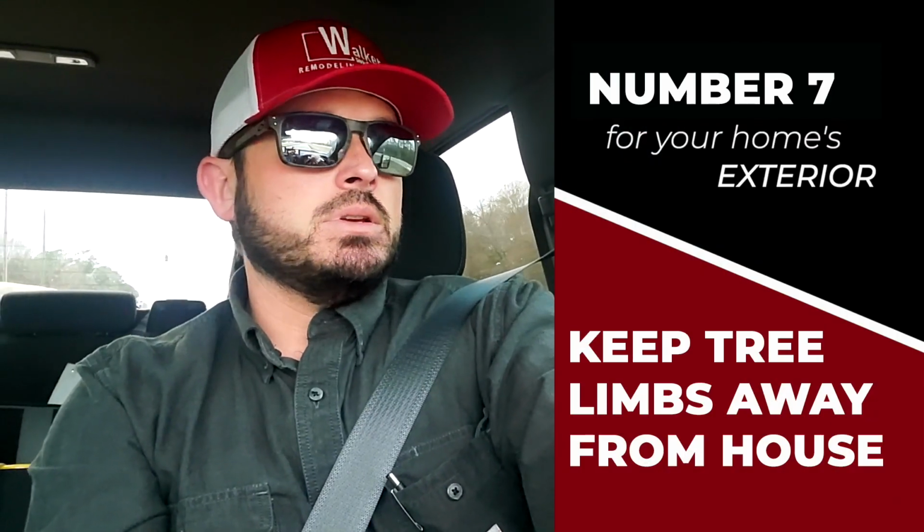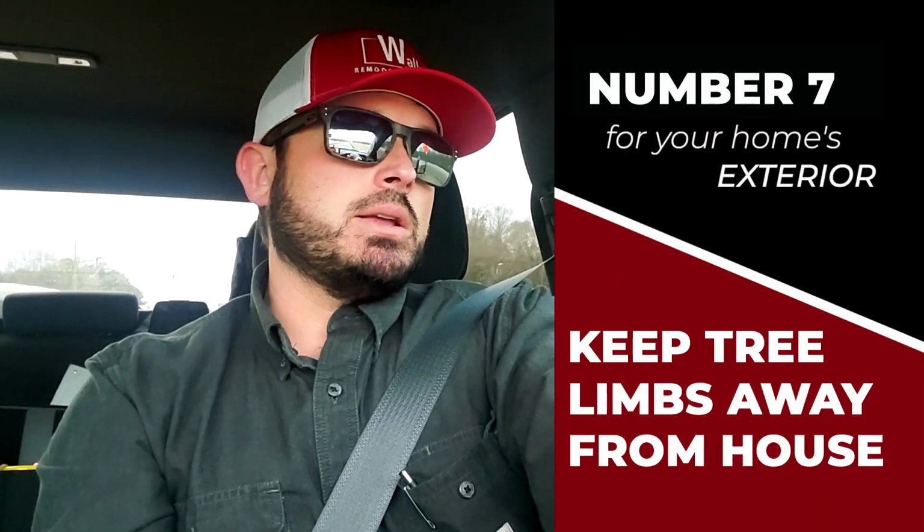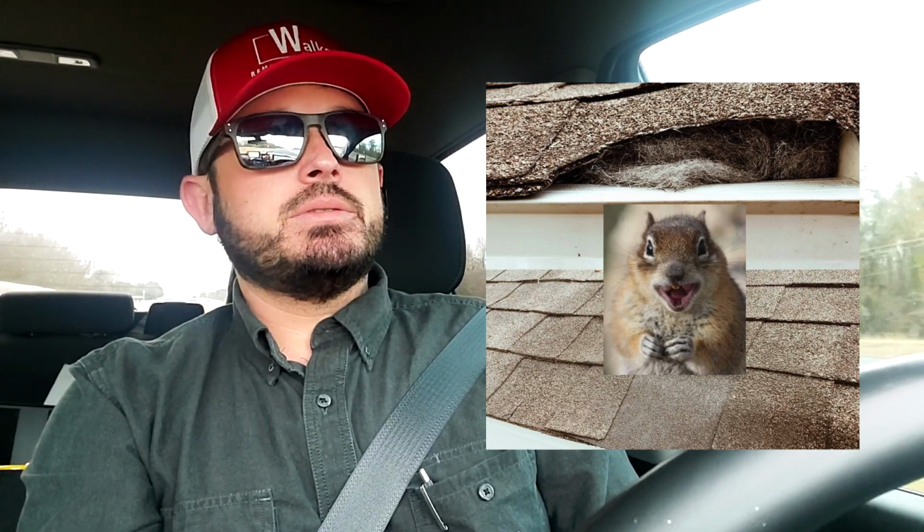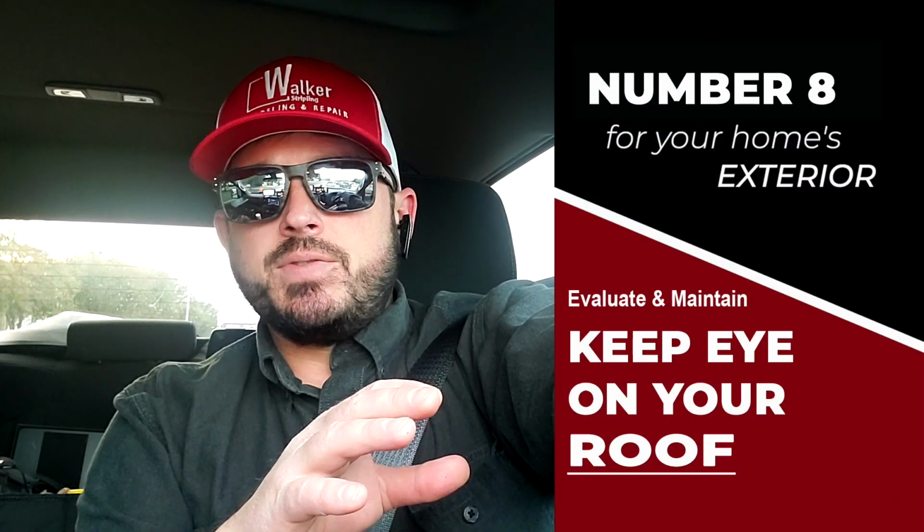Number 7 is limbs overhanging the house or touching the house. Keep them away from the house. The closer they are to the house, the easier access squirrels will have to the roof, and they like to gnaw into sidewall siding, fascia, soffits.